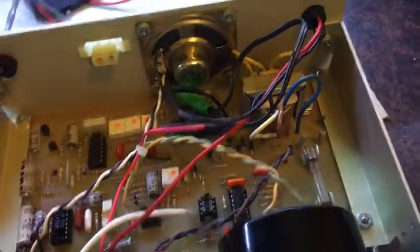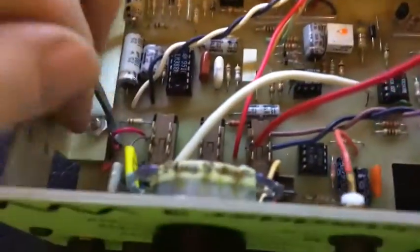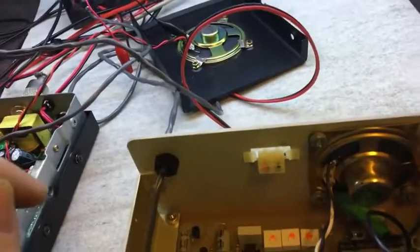What's happening is because this has been modified, it's now running 12 volts. The 12 volt is going to the negative of the chassis, so it's actually like the zero volt rail of the whole unit. And this clip lead here, which runs through the cable, is also going to the same place — so that clip lead was negative relative to DC.